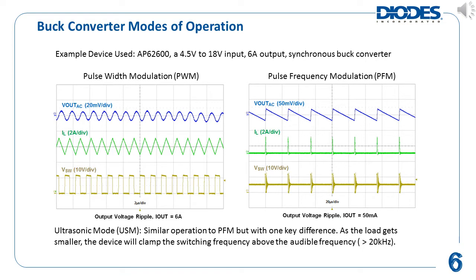The required output voltage of a buck converter can be achieved by two main modes of operation: pulse width modulation, known as PWM, and pulse frequency modulation, known as PFM. Devices operating in PWM do their switching following a fixed frequency, which happens when the output has a high load, so the buck converter continually has to switch to supply current to the output. PWM operation allows for small output voltage ripple, making it easier to filter the noise downstream. For PFM, the device switches to provide power to the output load only as needed while still maintaining output voltage regulation and meeting load demand. Thus, the average switching frequency in PFM is reduced. In theory, a device in PFM can wait as long as it needs to before switching again, so the average switching frequency can be very low. When there is light load, the current consumed by the buck converter itself is less since it is not switching as often, which helps the overall converter efficiency at light loads.